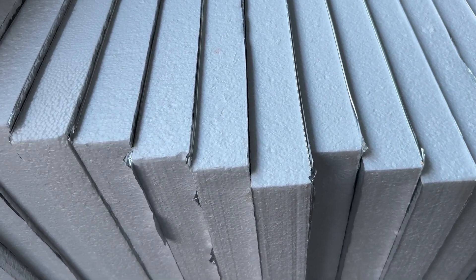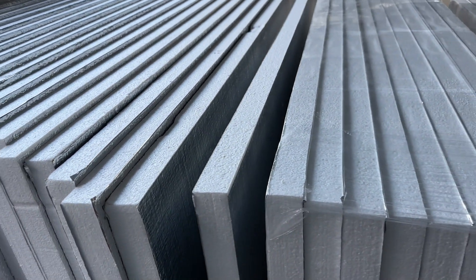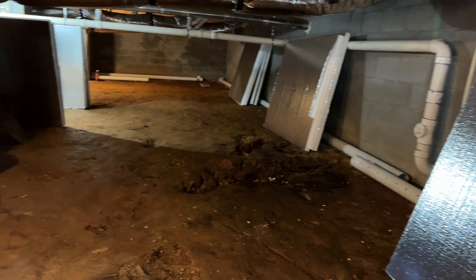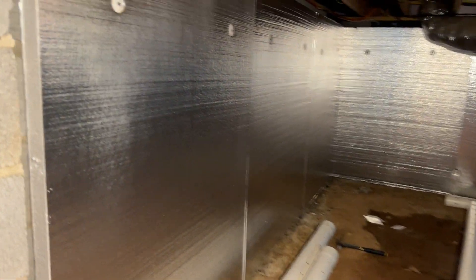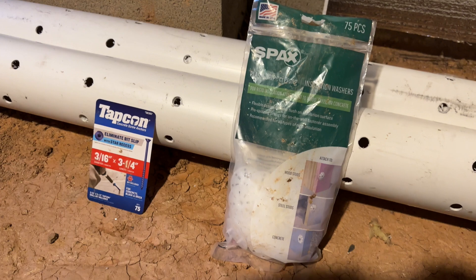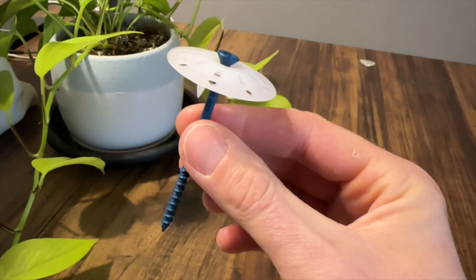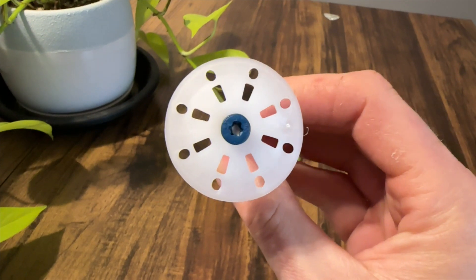Since we removed our floor insulation, we're going to add perimeter insulation to the foundation walls. I found two-inch-thick foil-faced insulation board on Facebook Marketplace — four feet by five feet, perfect for my crawl space since it's just a little over five feet tall. I highly recommend the foil-faced boards because they act as a vapor barrier on both sides. I've already got a few panels installed using plastic washers and Tapcon screws. My exact setup was a three-and-a-quarter-inch Tapcon with plastic SPAX washers from Lowe's — a concrete anchor screw where the plastic cap has cleats that push into the insulation and provide holding power against the wall.